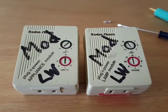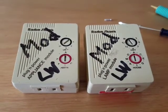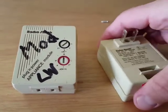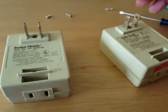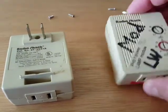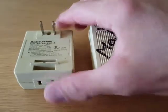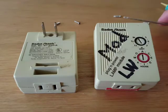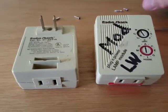The problem is when you have a low wattage system like LED bulbs or compact fluorescent bulbs, those bulbs stay on because of that 0.8 watts, because they barely take any wattage. This video shows how to modify each of these to turn off that local control and kill that 0.8 watts so they actually turn off all the way. This information is available online but wasn't in a nice format, so I put together a little video to help out.